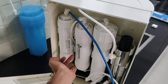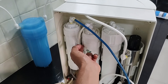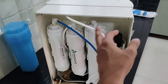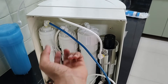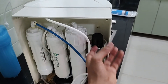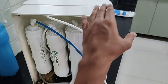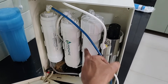From the carbon filter it goes inside to the pump. The pump pumps the water, but it goes through a solenoid valve before the pump. The solenoid valve stops the water when there is no electricity, or when the auto-stop valve signals that the tank is full. The solenoid valve stops the water coming in, and the auto-shut valve communicates with the solenoid and the pump to say stop — we don't have to pump any more water, the tank is full.